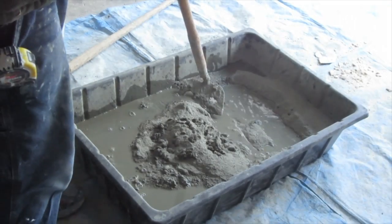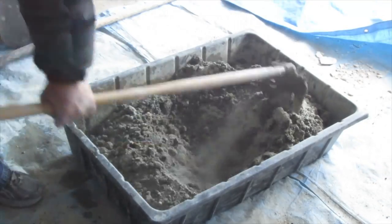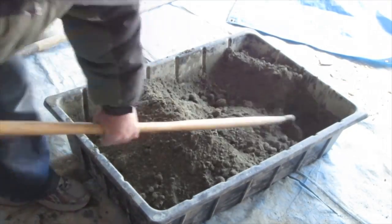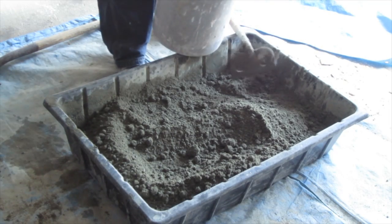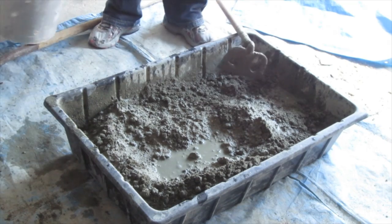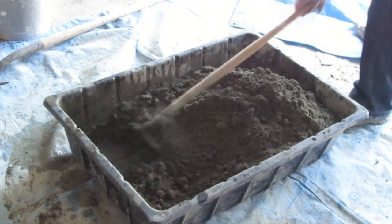So when you're mixing mud, you don't want to mix it too wet. You want to have it kind of damp. You don't want it soaking wet so it flows. You want it kind of damp so that you can shape it with your tools — your trowel, your wooden float, and stuff like that. I usually add like a gallon of hot water to about 2 bags of sand topping mix. Then I mix it up and check it, and if I need a little more water, I'll add a little more.